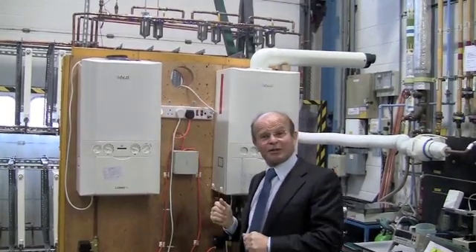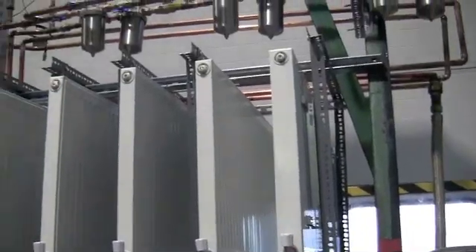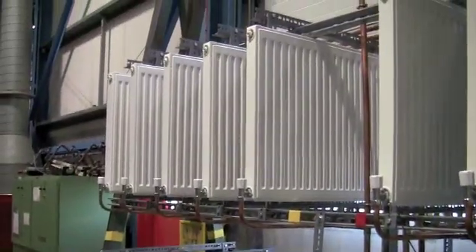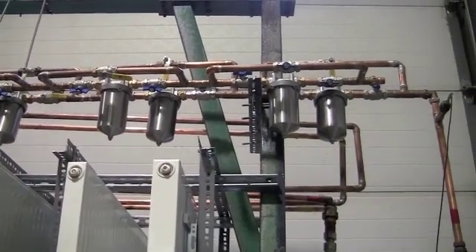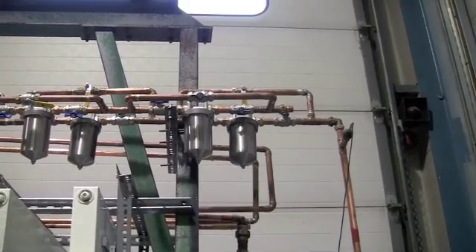I'll show you around the other bits. The two boilers are connected up by our flexible pipe work back through here. Here we have upstairs and downstairs for the hard water circuit, and then over the other side is downstairs and upstairs for the softened water circuit. And up along the top here you can see those stainless steel containers — they'll contain all the coupons which will analyse the corrosion that takes place in the softened water.